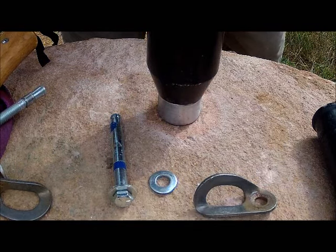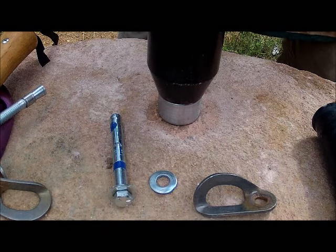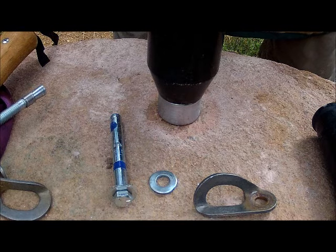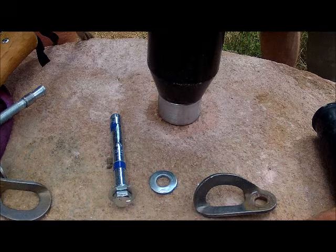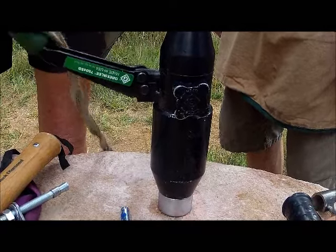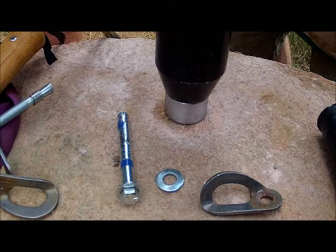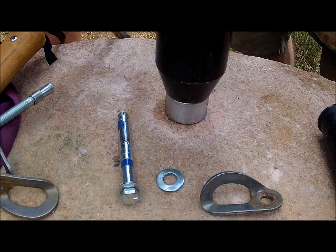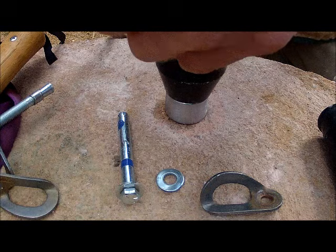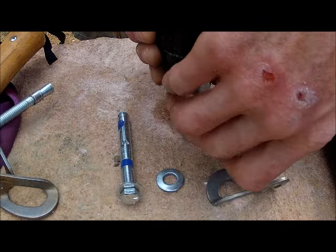You just turn it on. I can feel I'm only putting about five pounds of force on this lever — it's out of the camera frame, but you can see where the rubber meets the road. I can feel the bolt is slipping out. There's only one inch of travel for this tool, and when it gets difficult you've reached the end of that inch and you'll need to add a spacer. You'll know when you hit the hard stop. We've pulled one inch of bolt out of the hole, which gives us room to add our one-inch spacer.